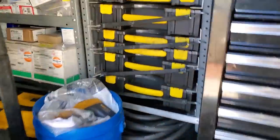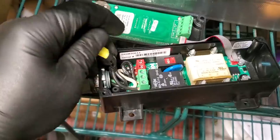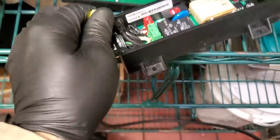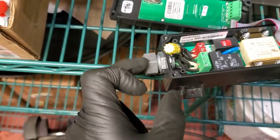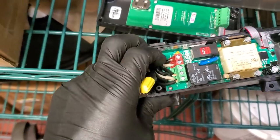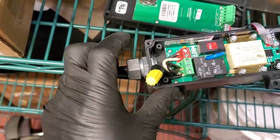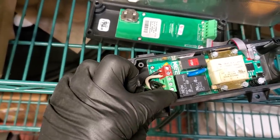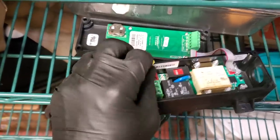This is the controller. I need to get some electrical fittings and an SJ cord connector to go to the bottom of the control to keep it a watertight connection. When I am wiring these, instead of trying to shove multiple wires into one terminal, I do individual wires and then wire nut them — three connections using a three-wire cord. The green wire gets black tape on it and goes to the normally open terminal. Black incoming line voltage splits off to power the temp control and the common terminal of the contact. Neutral comes up to the neutral terminal.